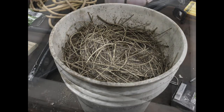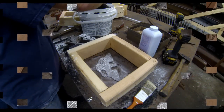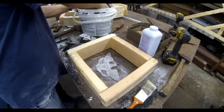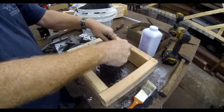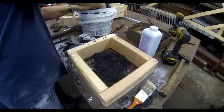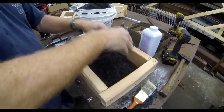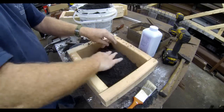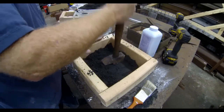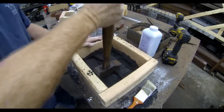This is the object that we're going to cast. I made a very simple single-part mold out of two-by-fours. I laid the object on a flat surface — in this case a metal table. I coated that brass eagle with baby powder just to make it separate from the sand a little bit easier. Then what I'm doing is sprinkling in the green sand or casting sand. This sand I made on a previous video — it's actually another DIY project. It's made with play sand or terrarium sand in combination with clay kitty litter.